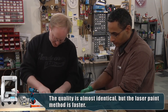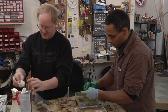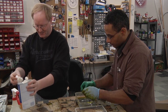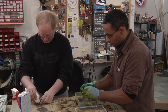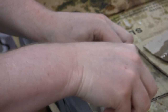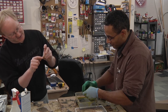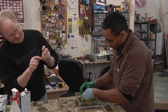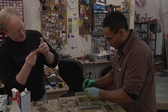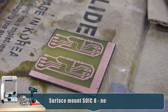We put the laser-etched board in some water to stop the reaction. Now acetone should eat that paint right off. It's pretty neat that etchant will eat copper but won't eat paint, while acetone makes short work of the paint. We were actually kind of aggressive with the circuit — we have traces going between vias. You can't quite see it on camera, but you can definitely see a raster dot pattern that results from the laser. Even when the laser tries to make a completely solid square, it has a resolution — on the edges where it transitions from black to white, you get the very edge of a dot pattern, just like an old newspaper.